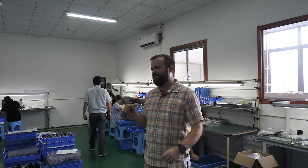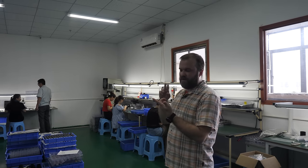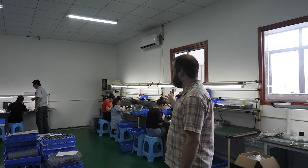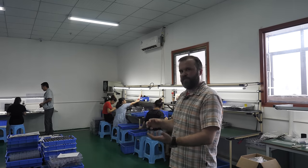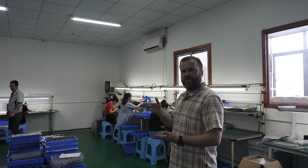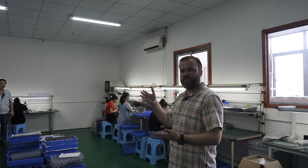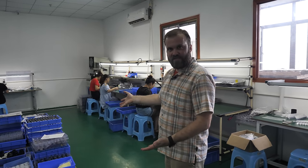This is the much quieter, air-conditioned quality control room, so we'll spend a little bit of time in here. This is where they take every single part made out on the factory floor in all those CNC machines and make sure it fits their quality criteria — appearance, no imperfections in the anodizing. They also check tolerances with a whole bunch of calipers to make sure the dimensions are up to spec. They want every flashlight body to fit every tail cap they make for the model — not just now, but down the line, so warranty replacements in three years fit bodies made today.